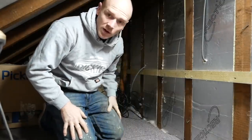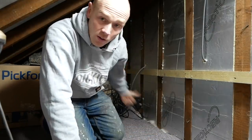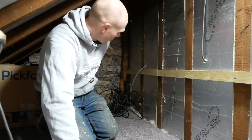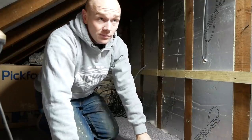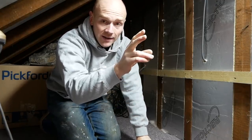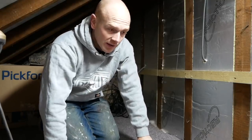It's a bit fair weather DIY today, certainly for the first hour. What I need to do is drill a hole in the stone wall at the back here to take the soil pipe from this stack. We'll be working out there a bit later, along here with a good fall on it to where in the future I may hopefully get around to putting an ensuite up here on the top floor. Just makes sense to do it all now while we've got the scaffolding out.